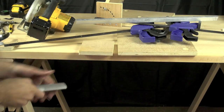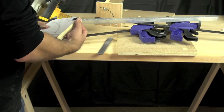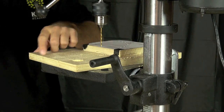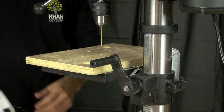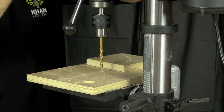Now we've got our piece and we're just going to file it off quickly to clean up the edges. Then we're going to tape a pattern printed from the computer and use our 3/32 inch bit to create pilot holes. Then we'll use our five-sixteenths inch bit to finish off the holes to their full size.